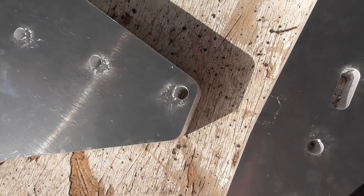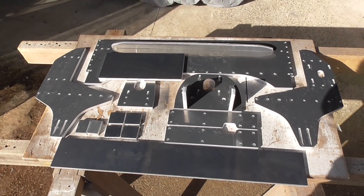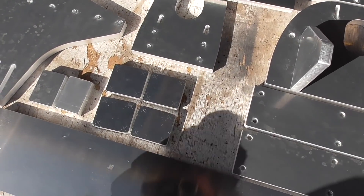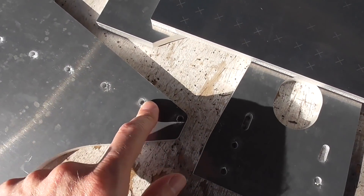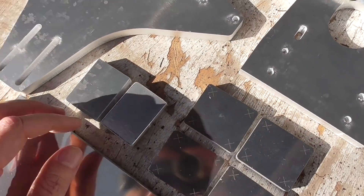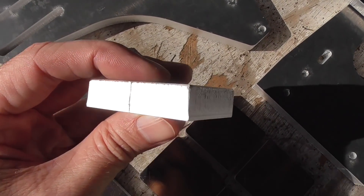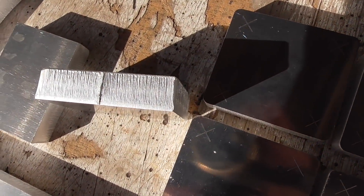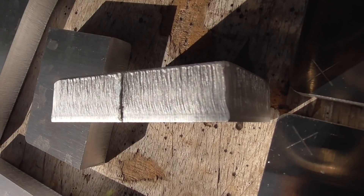I was going to do that with this one here being very close to the edge, but I didn't need to bother and I'm glad I just had that one cut - it will save me trouble because a larger plate becomes a little bit tricky to manage on the drill press. This is actually all the plates here except for the main big one which is still in the car. The sizes are all very accurate. One thing about these holes though is that you can't quite get a bolt through - these are five millimeter holes but the edges are not perfectly clean.